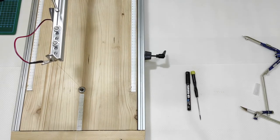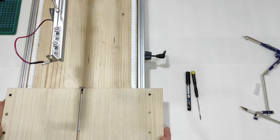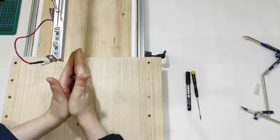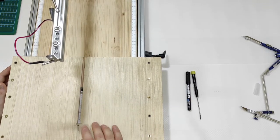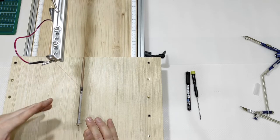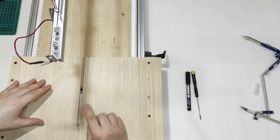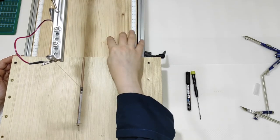I have some jigs. One of them is this little add-on that by chance has the same width as the guides, and you can go this way. It has a little groove in the middle to allow the hot wire to travel through it, and a nail here. This nail indicates the center of the geometric form you need to do. This is especially done for making cones if the wire is not perpendicular, or rings, circles or cylinders if the wire is at 90 degrees with the plate.